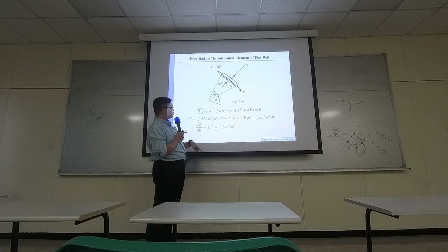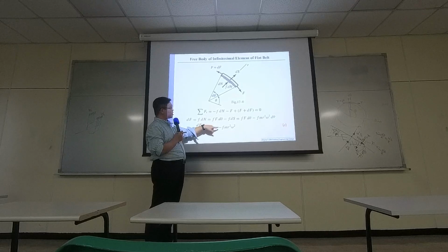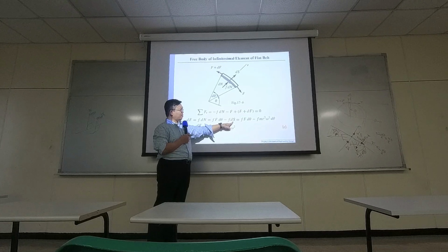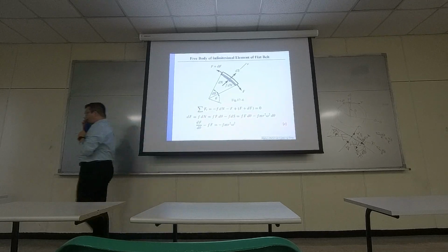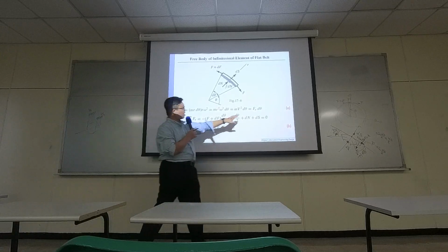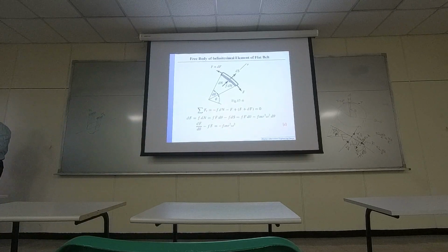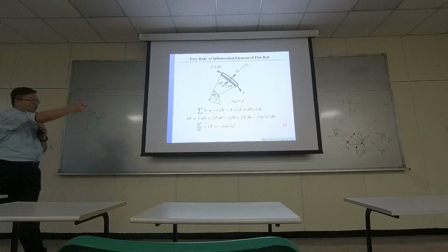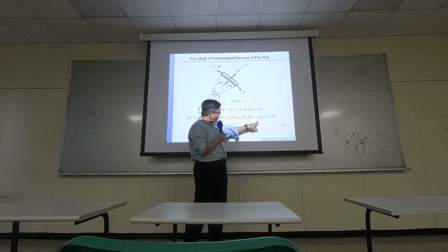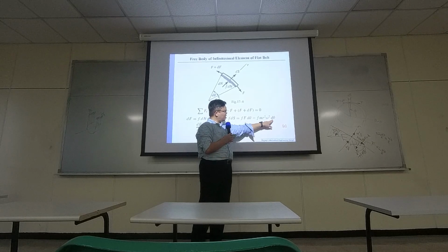So dn is replaced by f. This is the friction coefficient, this is tension force, d theta, minus friction coefficient, centrifugal force. And centrifugal force was derived earlier. ds was fc d theta. So you can just plug in. And also fc was derived. So after you plug in centrifugal force, you have friction coefficient, mass per length, radius, omega, and then d theta.